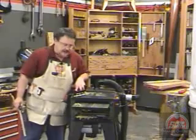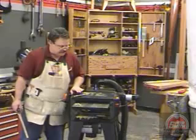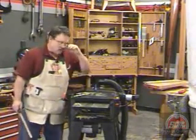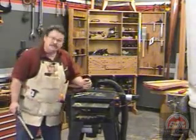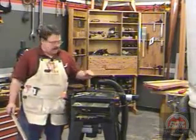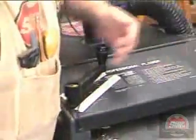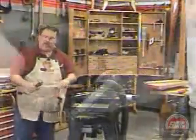I put these two pieces of masking tape here to show me when I'm right on the 16th of an inch. I know right here if this is .75, I can turn this like this, and now I'm exactly at 11/16, 5/8, 9/16, 1/2, and so on. I know right where those are. So I can use this as just a reference to know approximately where I am, but these two lines here tell me when I'm right on the money.